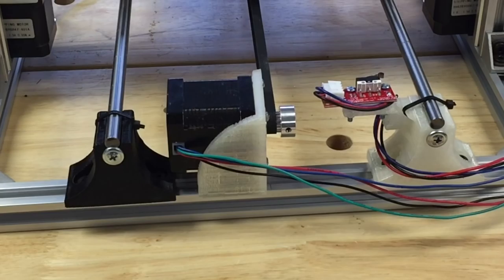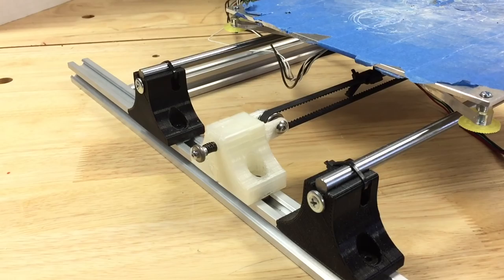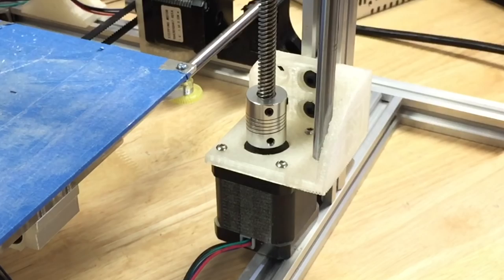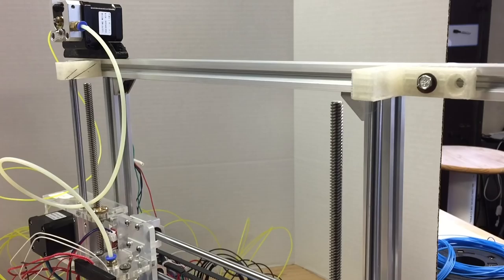Here are the pieces I found on Thingiverse — it's the Scalar Family 3D Printer by 3D Modular Systems. All the pieces were designed for 2020 aluminum frame construction. I started by making the mounts for the rods of the Y axis, then a motor mount and a tensioner for the belt — that's two pieces. The belt was a little short, so I custom designed a belt connector in Tinkercad for underneath the bed.